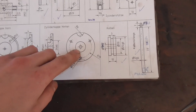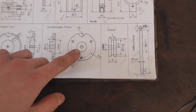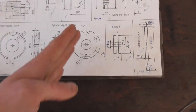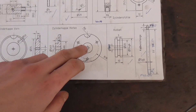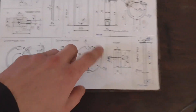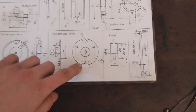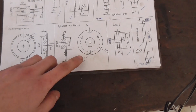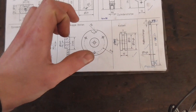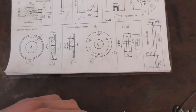You see, if I made this boss here 24mm, made the other one fit, and then some error in concentricity sneaked in — like the plane face not being exactly aligned or the hole in the middle not aligning perfectly — then I'd just have to throw it in the bin. So I'm going to call this the AK-47 principle: make this as rough a tolerance as possible and keep a little bit in mind while adjusting it to make it good.